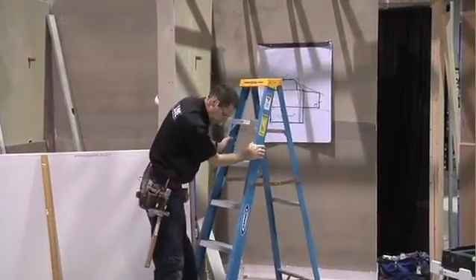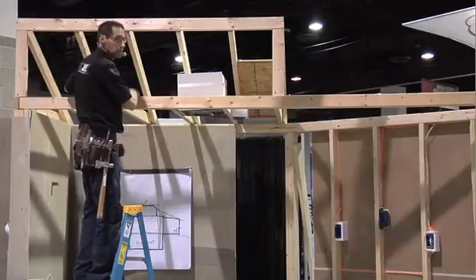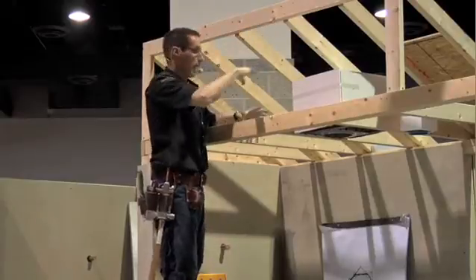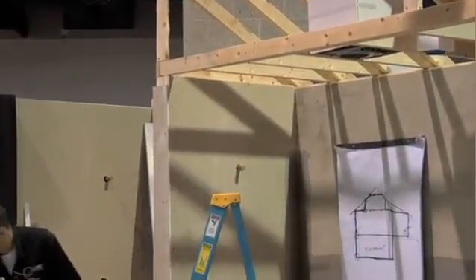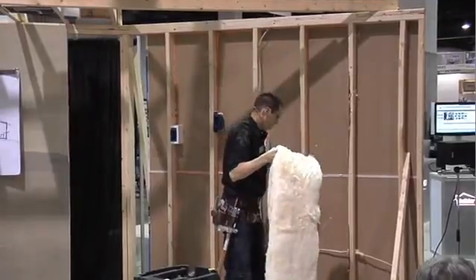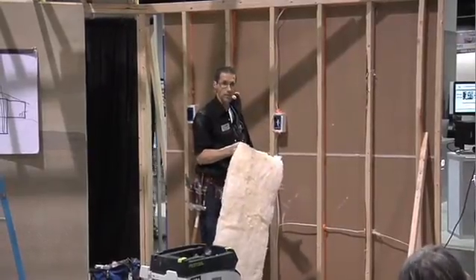The electrician I work with a lot has been helping make it easier to insulate with fiberglass. When he runs his electrical wires, he doesn't run them right on top of the ceiling joists — he'll run them up higher, eighteen to twenty inches. The guys running plumbing vent lines keep them up too, so when you're insulating you have fewer obstacles. Like this wire over here — it's in the way, making it difficult to do a good job insulating. Why can't that wire run way down low, or by every outlet they drill down and run the wire through the basement? Because the electrician doesn't want to — it costs too much.